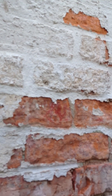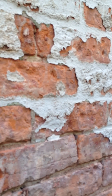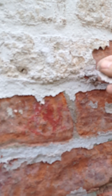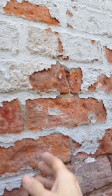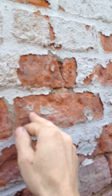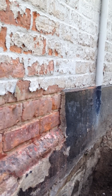The heritage guys said that paint can be very bad for buildings, especially on this old brick, because water can easily get behind the paint as it comes off the building depending on what kind of paint you use. The water just needs one entry point and then it forms pathways behind the paint all the way down, which basically destroys the brick — the brick doesn't like being soaked in water, and it expands and contracts with frost, creating this result. So I might actually just take all the paint off; most of the brick seems in pretty good shape, and I'll then have a brick wall that can breathe and isn't damaged by frost cycles and moisture.